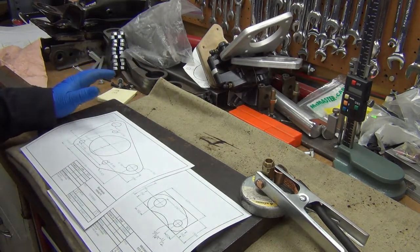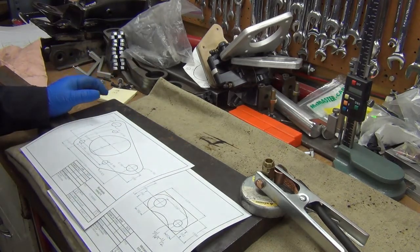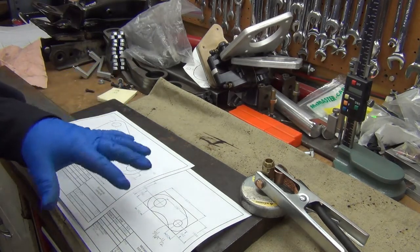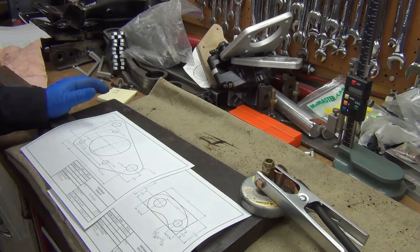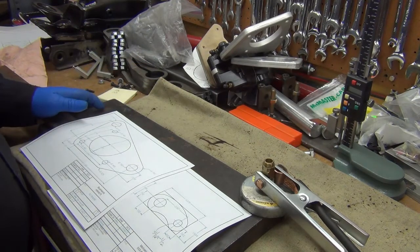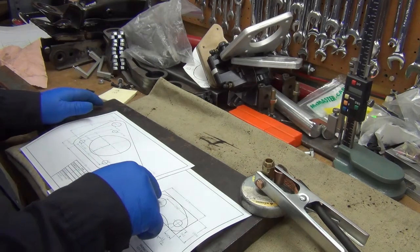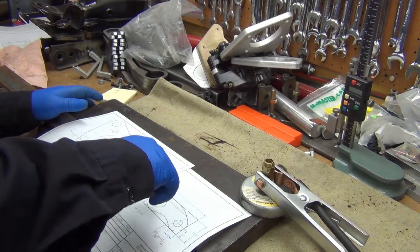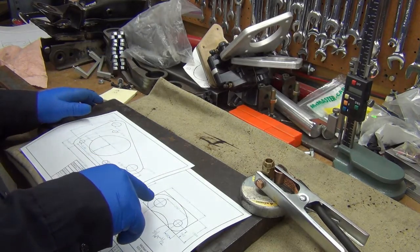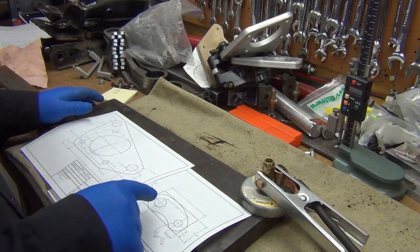With all the research I did, three quarters of an inch turned out to be the best size — even for bigger, thicker plates. Three quarters of an inch seemed to be the better choice. Professional welders, feel free to chime in. With the plug weld, I should be able to just come down in there and weld and fill it right in, instead of having to do a perimeter weld.